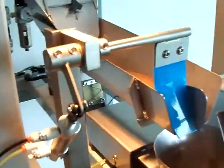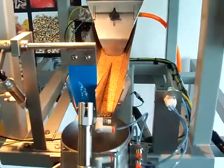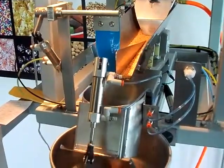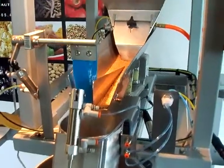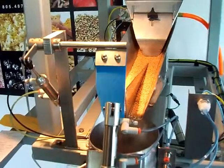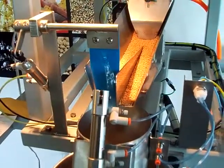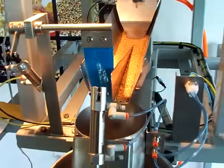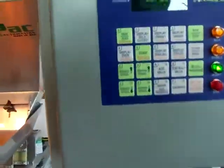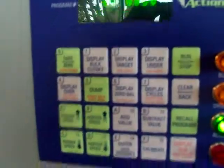It's already been set up, calibrated, and tuned for the speed and accuracy that the customer wants. All you do is press five, open up the bucket manually, and then press run. You'll see the bulk, then the dribble, and then the perfect accuracy of the dribble side — and we're running five grams here, five grams exactly.